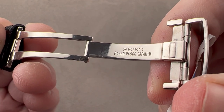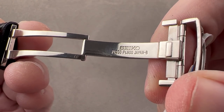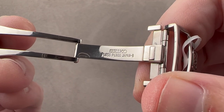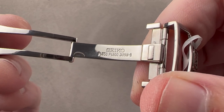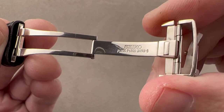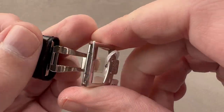That might not strike you as unusual for a Japanese watch, but keep in mind that the Grand Seiko gold buckles — whether yellow or rose — are made in Italy. The platinum Grand Seiko clasp is made in Japan, and in order to include a full platinum clasp, Grand Seiko uses a combination of PT950 and the harder and more mechanically durable PT900. This is where many Swiss brands give you a white gold clasp, claiming platinum is too soft for the swing arm mechanism. So Grand Seiko uses PT900 for the swing arm to reinforce its strength.